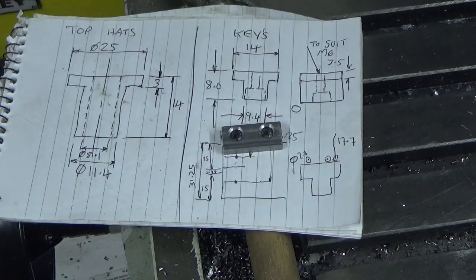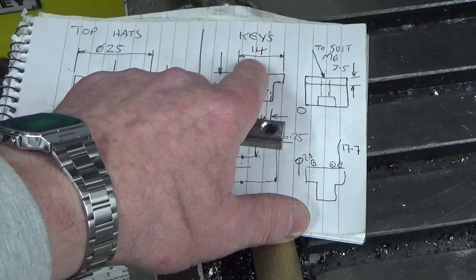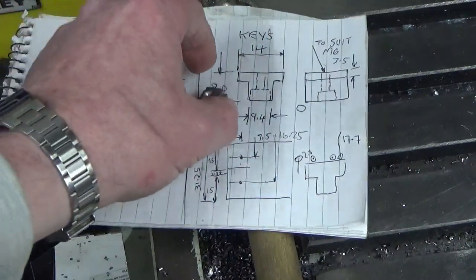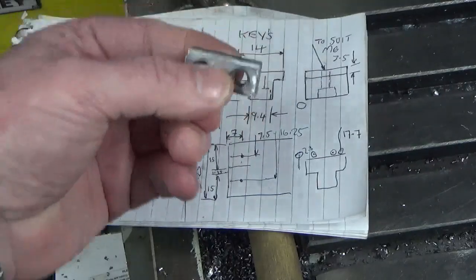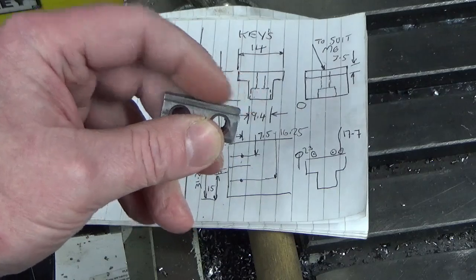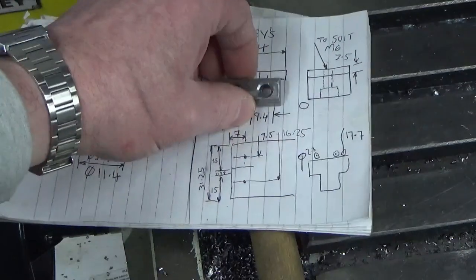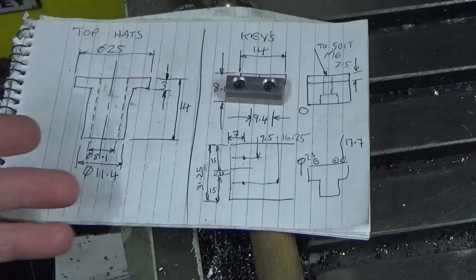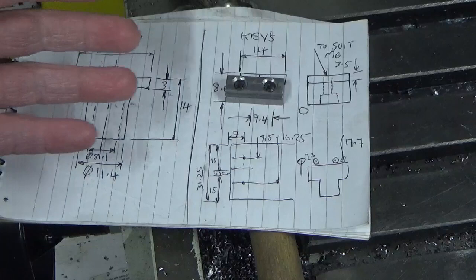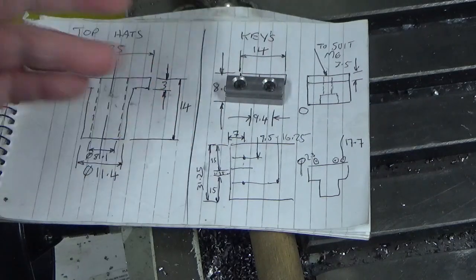So I tipped the vise back up again, got the measurement gear out, and the slot in the bottom of the vise is 13 millimeters, not 14. So, measured twice, cut once. So after doing a great job of demonstrating how to make something to print, I probably need to focus a little bit more attention on how to measure something up in the first place. So, not a drama, what I'm going to do, and I'm not filming it, I'm just going to drop this back in the vise, and I'm just going to dust half a millimetre off each of these edges with the end mill I've already got in the machine that you've seen me using. I'm just going to run half a millimetre off both of those edges to get that down to 13. And job's a good one, despite the fact it wasn't a good one first time round. But as I've always said, I'll always show my mistakes. I'll bring you back in a bit when we're moving on to the next stage.